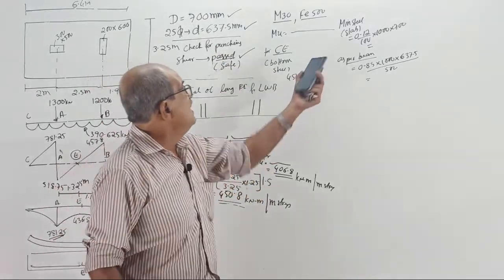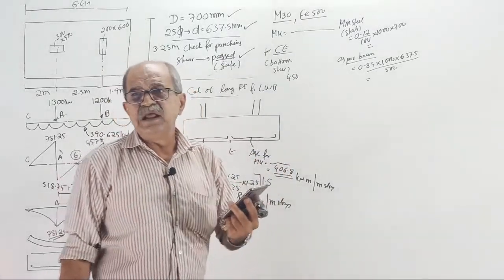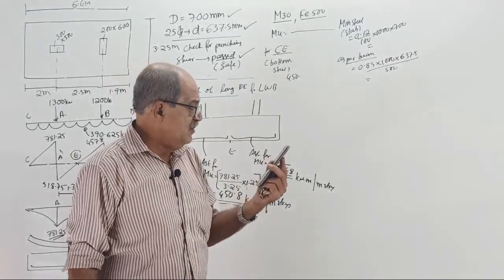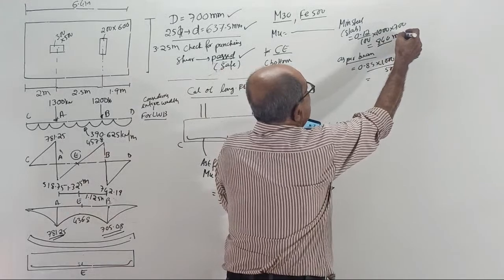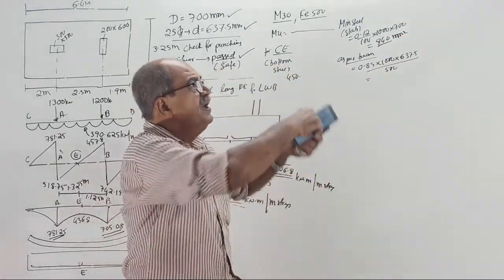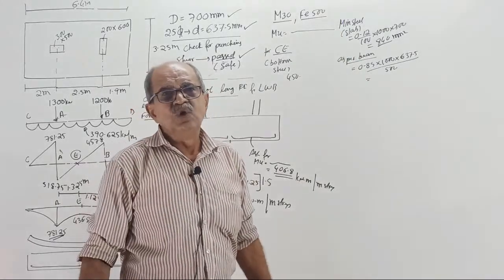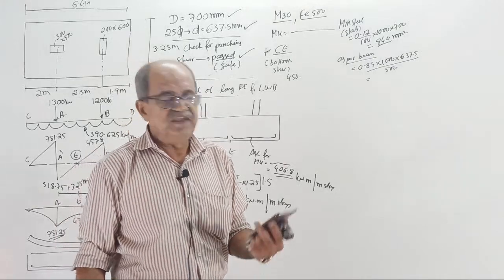How much is the minimum steel as per slab action? If you consider it purely as a slab, minimum steel is 0.12% of BD. How much? 840. Okay. Now, instead, I want to consider this as a beam, because 1 meter by 850, 700 millimeter is like a beam only. So, it is our version. Nobody can tell tomorrow it is a slab. I will tell them, keep quiet. Don't talk about these things.